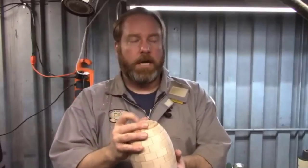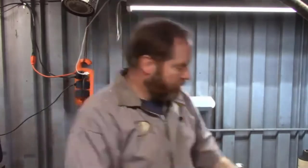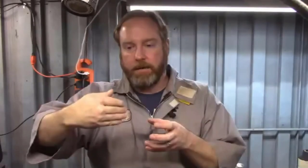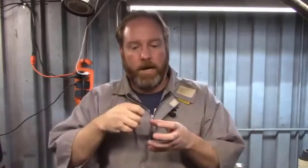Kind of like, Mike, I think you do that on your drill press. Yes. Yeah, so the same thing, but I'm just doing it freehand. Yeah, I moved mine to where mine's a Jacob's chuck on the lathe. On the lathe, yeah. It's smart to hold the piece and adjust, because the drill for me seems to wander and I end up touching part of the thing. Because when I create that dish in the bottom of my pieces, I tend to go a little bit deeper, so that when I'm sanding that, I will kick the drill sander off. So I'm really just sanding on the corner of the sanding disc, and that helps me avoid skidding off and hitting some of the details I work so hard on.